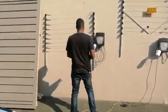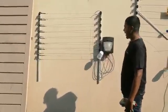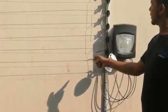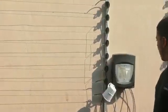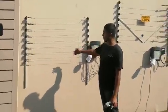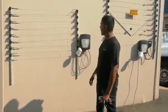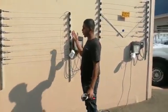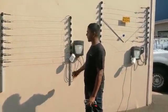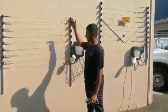Now we're going to look at a typical fence that most guys would install at a cheaper price. As you can see, there are no line clamps on the HD cable, no Denso tape, no warning signs, no surge arresters, and the fence is wired in parallel. I'm going to demonstrate by cutting a wire and showing the siren won't trigger. We do not recommend this. If you have a fence like this and are thinking about selling your property, you're not going to get a COC for it.